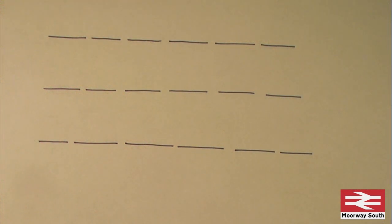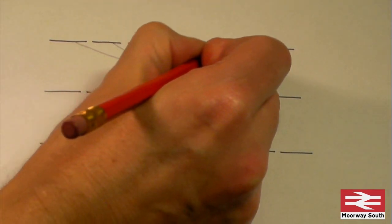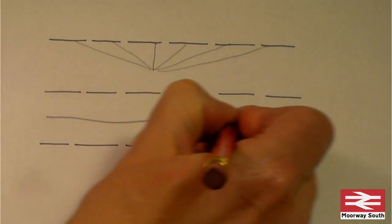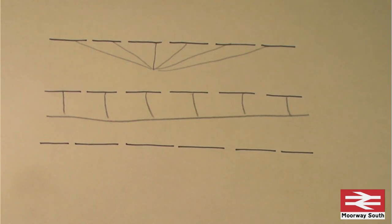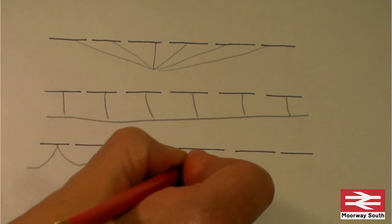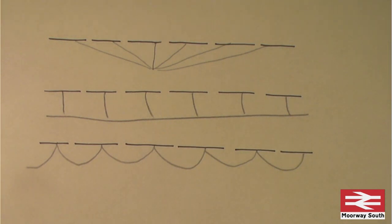Because I'm wiring up each piece of track individually, there are several ways this could be done. I could simply have a wire that runs to each piece of track, but clearly that's an awful lot of wire. Or I could have a single bus, which is quite a common approach, and then link in wires to that. But the approach I've gone for is what I call a leapfrog approach, which has the least wiring of all, but also allows each section of track to be disconnected via the terminal blocks, and achieves the same result overall.